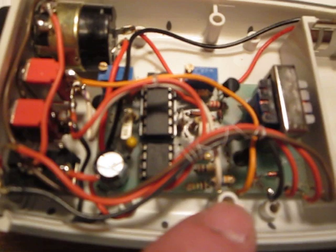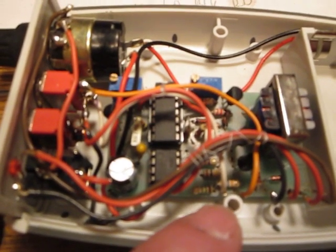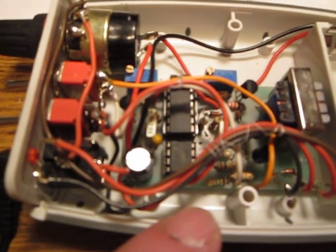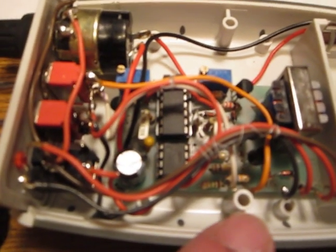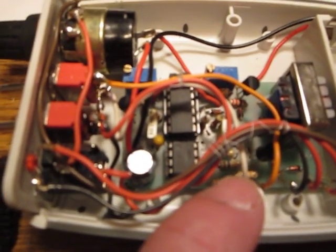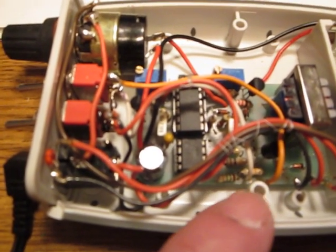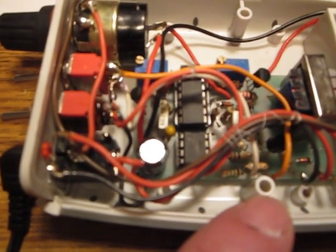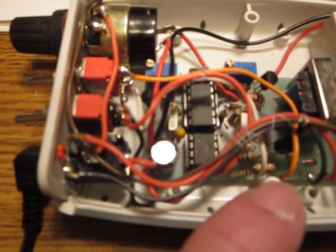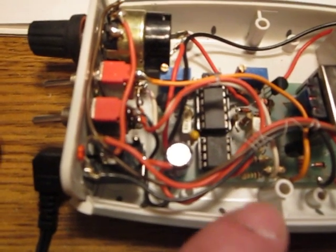But again, you have to experiment a little bit with this, because due to the tolerances of resistors and the capacitor, it might be different in your case, maybe 148, 146. So 1.5 meg is a pretty safe bet for a slow pulse, but for 5 hertz you should experiment, or just use a 100k trim pot and a 56k resistor, and you should be fine.